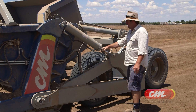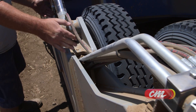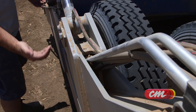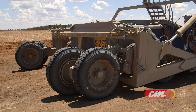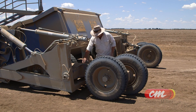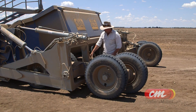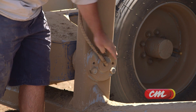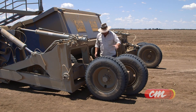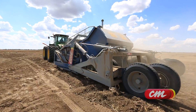The axles and rams and shafts are all bigger here. We've talked about the hydraulic hoses, but you can see here they've incorporated them into the frame — they've made the hoses hide underneath here so you don't have them hanging out the side, easier to clean. They've put a lot of thought into it. The whole rocker beam system has been sized up as well — a lot more strength and size in the beams. The pin running through here is bigger, it's all on the auto greaser, so we're hoping to get longer life out of the pins. The tyres are bigger, the hubs have got bigger bearings and bigger shafts inside them.